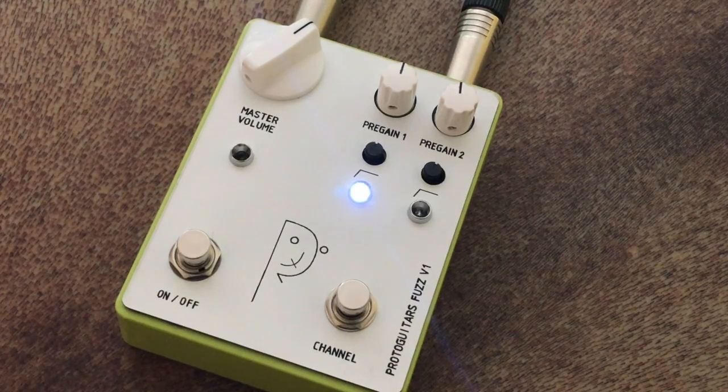That's the concept — you can jump to different presets. There's also this little tiny tone control knob, because often when the fuzz is at max, it's too bassy. Or when the fuzz is low, it's not bassy enough. So instead of a standard tone control that adjusts the highs — the highs are always coming through — this actually rolls out low-end. It feels like a sort of treble boost as you turn it clockwise and roll out the bass, but it's not. It's just a perceived treble boost because so much low-end is disappearing. Conversely, when you crank the bass, it feels like you're rolling the tone knob down, but it's just so much bass that it starts to become darker and woolier. How it feels and functions versus the technicality of it might be two different things, but it's pretty intuitive once you start messing with it.